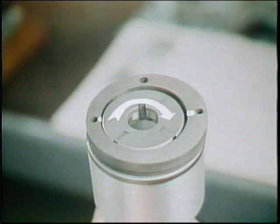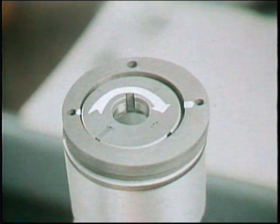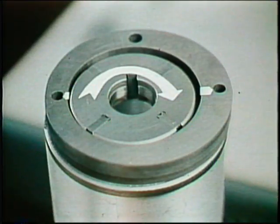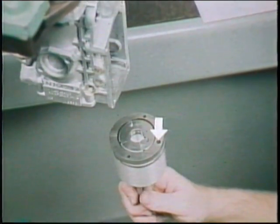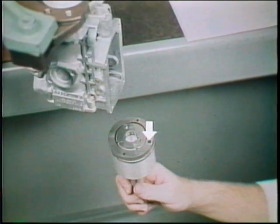Notice these two holes in the eccentric ring — they're not equally spaced to the inner wall of the ring. This is a right-hand rotation pump, so the hole farthest from the inner wall must be to the right. If it were a left-hand pump, this hole would be to the left. As you get ready to install the pump, position the third hole toward the open or governor side of the pump.